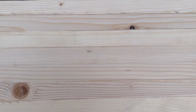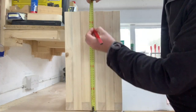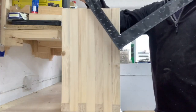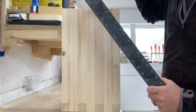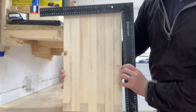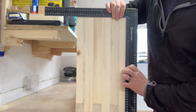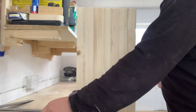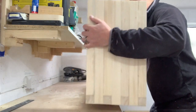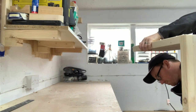The bench was sanded and looking good. The next day I started off by tackling the inconsistency of the leg height. I turned the bench upside down and measured up 450mm using my workbench as a reference point. I only needed to shave off a couple of millimetres to make it flush. The inconsistency must have either come from the glue up or from the bench top being slightly out of measurement from milling. I was struggling to make a line across so I lifted the bench onto its side, giving me a relatively flat surface to rest on.